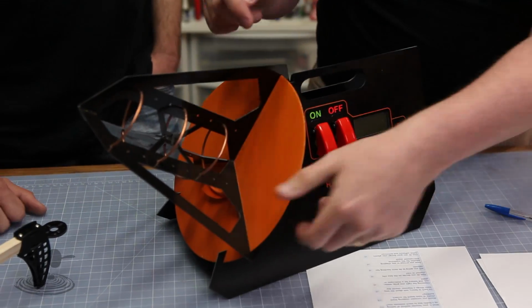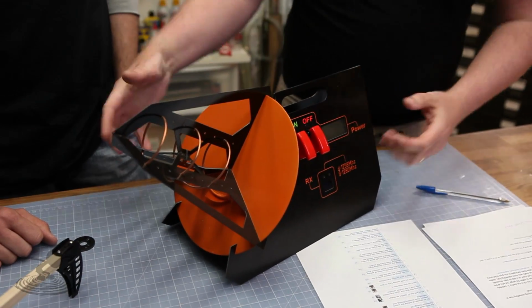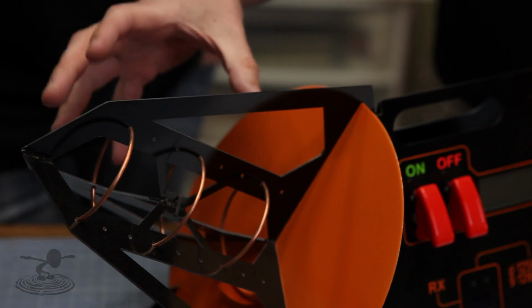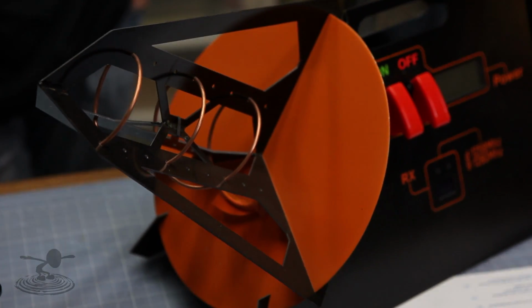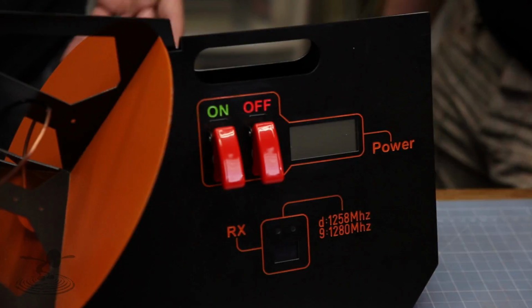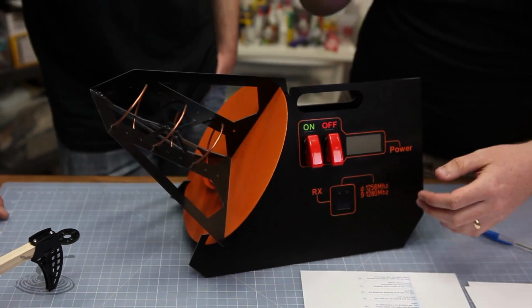What it is, this is a lid cover you have on your stove. I cut that, and then I CNC these parts, and this is just a helical antenna, 3-turn. Perfect amount of range and incredible coverage. In the X8 episode, half the time we were flying behind us, and we're sitting next to it blocking it, and it picks up everything.